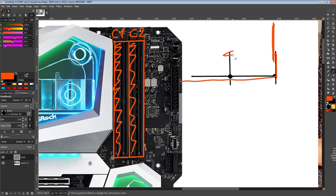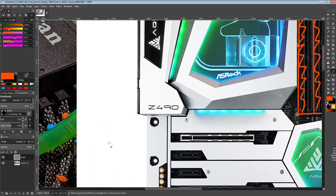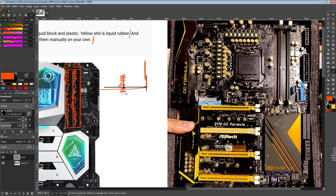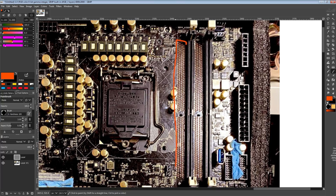You could try to remove a slot, but you'd still be left with a very long memory trace — and that's ultimately not what ASRock did. Interestingly, ASRock has actually done this before. This is a Z170 OC Formula where in manufacturing they decided to leave out the two unnecessary extra DIMM slots to try to improve the memory overclocking capability of the motherboard.